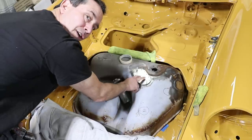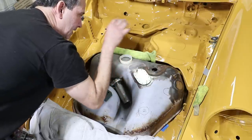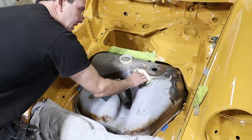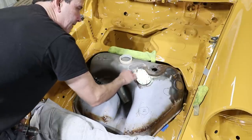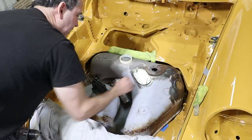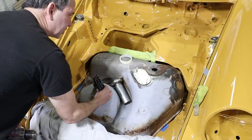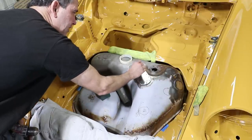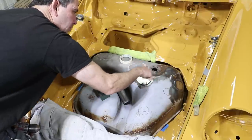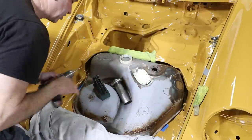These holes are drilled undersize because I'm match drilling them now together. So I didn't CNC this upper part, and these parts were made separately based on the paper templates. But I have these transfer punches holding the hole positions and an extra drill bit. It's holding the two holes that line up, and then I'm just gonna go through and make sure the other two are matched to size.